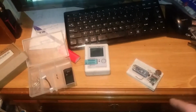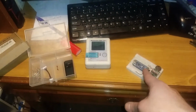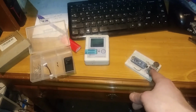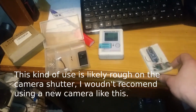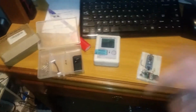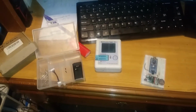with this Arduino thing, and this is an infrared remote for the Pentax cameras, and these people found a cool way to use the Arduino to send a trigger signal to this remote through this NPN transistor here that would automatically, based on the programming on the Arduino, trigger it however many seconds you wanted, or do whatever you wanted, I guess.